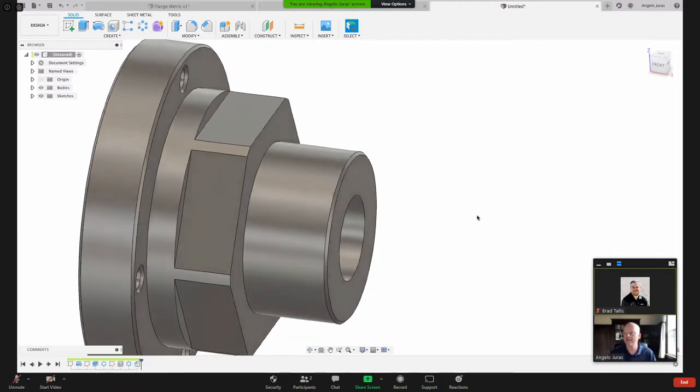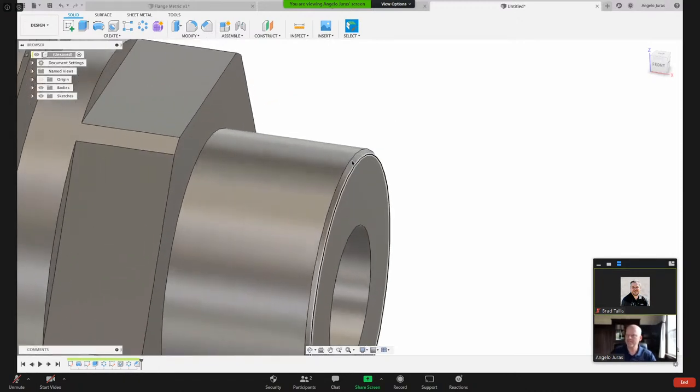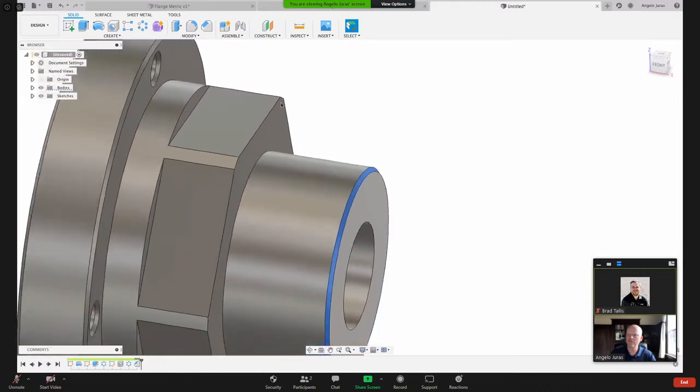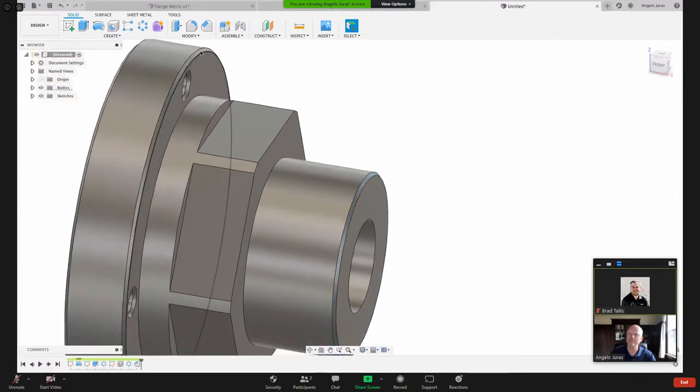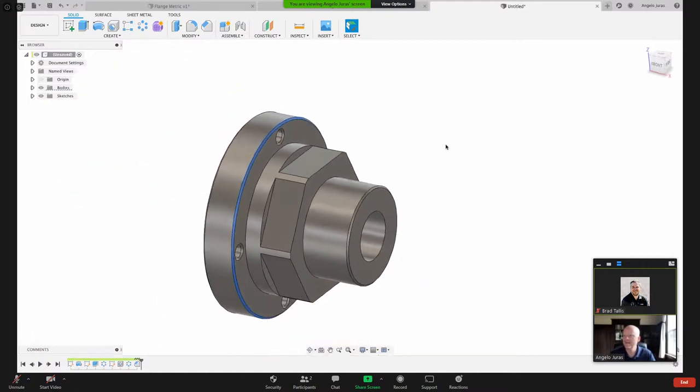I'll let the milling cutting tool generate that as my milling tool goes around and generates that, okay? And these chamfers here, this is going to be generated by the turning tool, this one and this chamfer right there. Oops, I accidentally grabbed the edge. So those faces are going to be done by the turning tool when the turning tool profiles around the outside, all right? Okay, so now I like that.